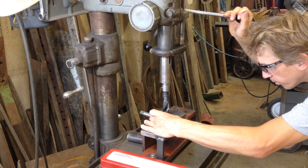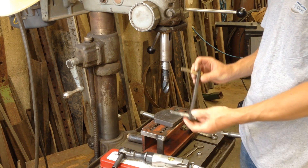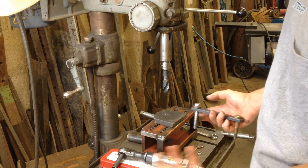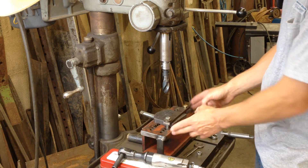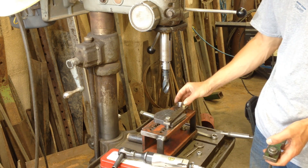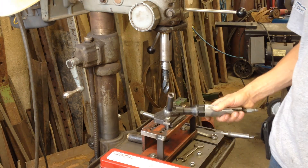Let's get this centered and clamped down. I'm going to get myself a good set of toe clamps. I have a whole selection of strap iron and angle iron bits that I use to clamp things down. I usually cross a piece like that and then use another piece of strap iron with a spacer depending on the thickness of the metal. There's a toe clamp over there and I run them down with the air ratchet.